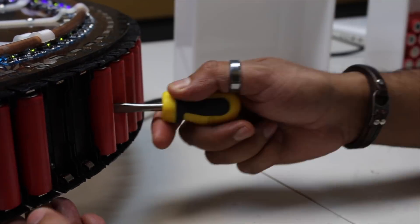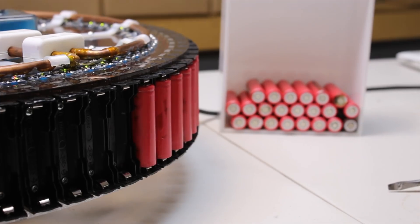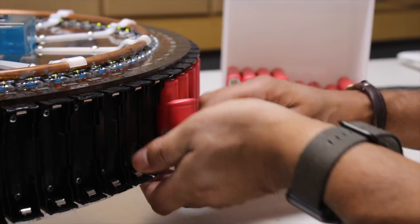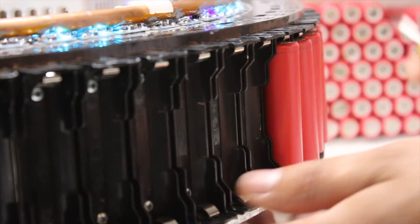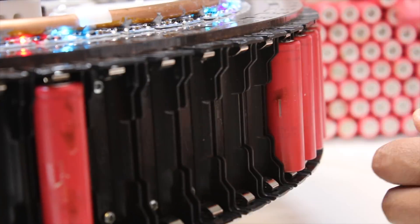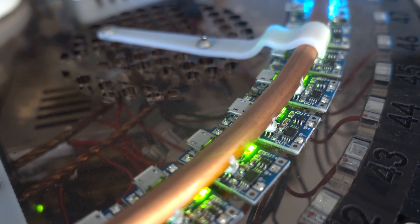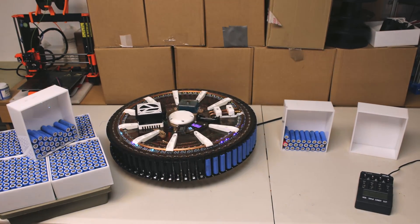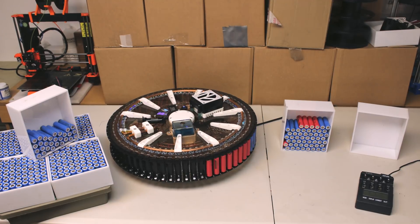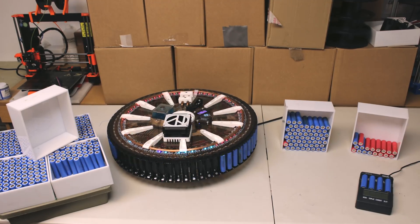I wasn't expecting this beast of a charger to chew through these cells in such an efficient manner and I'm honestly amazed how well this copes. Having run this for a full nine hour period, repeatedly swapping out charged cells and even an overnight run as my confidence in this machine grows. A typical cell using a single TP-4056 module can take between three to four hours — so it doesn't matter if you're charging one or a hundred cells with their own TP-4056 modules, it will still take three to four hours. For this setup that's approximately three minutes per cell, and frankly that's amazing.